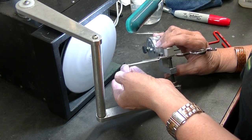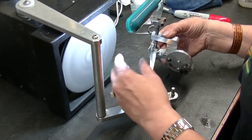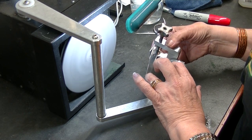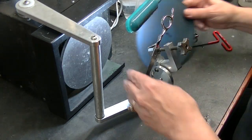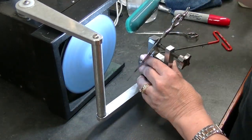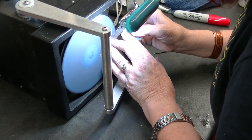I've worked this quite longer than what you're seeing on this video. Even though it's speeded up I've edited out a lot, and I'm checking constantly to see if I have a burr. It's a difficulty getting and feeling the burr at the tip, so always use your finger on your left hand — it's a little bit more sensitive. Now that I have the burr I'm going down to a smoother grit to get some of the scratches out and give it a smoother edge.